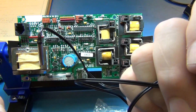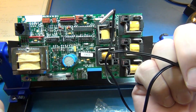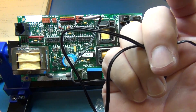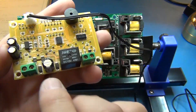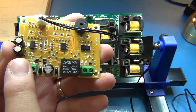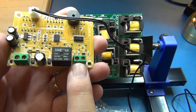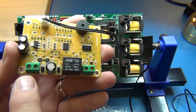So if I can essentially just drop that sensor in the tub — or maybe reuse one of the sensors that hook up to this board, I'll test to see if it's similar or functions the same — either way that will work. The back of this controller has a relay on it, and it's only got the one relay, so you have power and then the relay switching a circuit between these two points based on the temperature coming in.